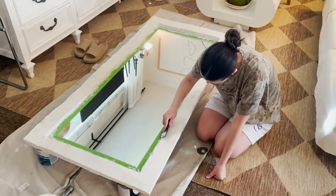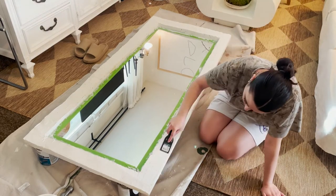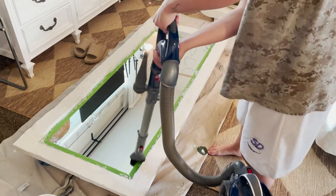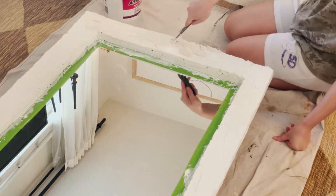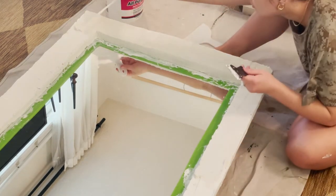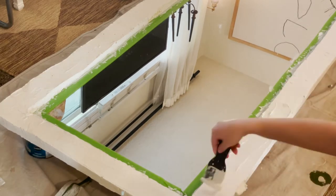I'm just scraping off any of those bumps with that two-inch spatula, and then I'm going to go in and vacuum off any of the little flakes that came off. I'm propping up the mirror on some quart-sized paint cans to keep it off the ground. Then I'm going in again with that two-inch spatula, spreading the compound on, but then I'm going to use a larger spatula and smooth everything out. This is really going to help minimize all the lines and the texture that you're getting from the smaller spatula.